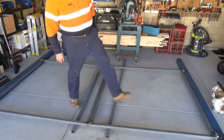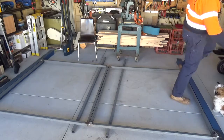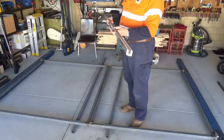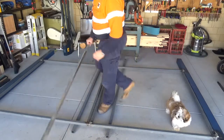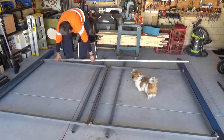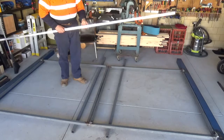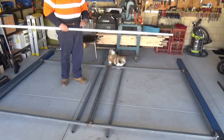And in order to hold them, I got myself a bit of aluminium, which is actually aluminium channel, like a U channel. I'm not sure if you can see that. So that will go along the sides, for example, inside here, inside the frame, and I'll cut them on 45 degrees and connect them, and then along the middle it'll be another aluminium profile which will hold all those woods, or should I call it boards, together.